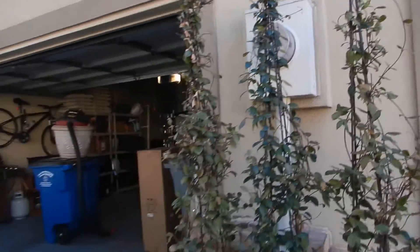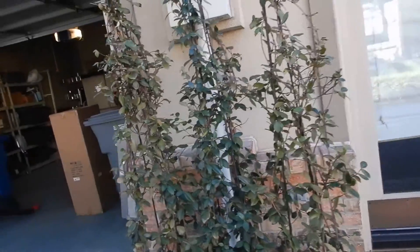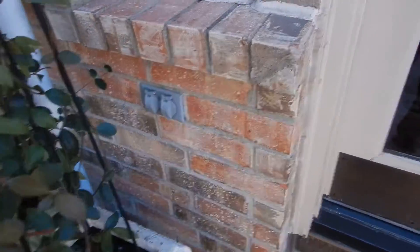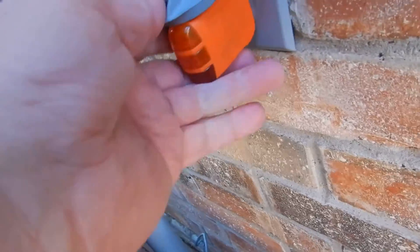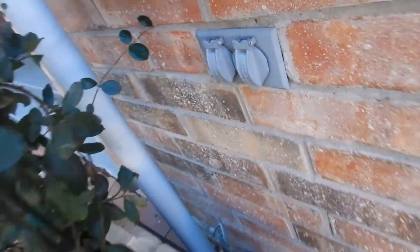This is an electric meter between the garage car entry and the back door. These exterior receptacle outlets should have protective covers on them — 'in-use covers' is the technical name. Bubble covers and that kind of thing. This outlet is GFCI protected, but we do not have a GFCI label on it.